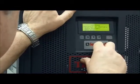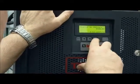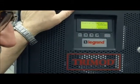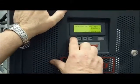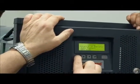Option, startup on battery, is disabled. You have to set it to enable. If you set disable and you have only a battery, you cannot start the UPS. You must have battery and input. If you set enable, you can start the UPS with only the battery, the cold start.